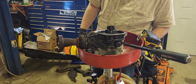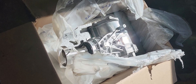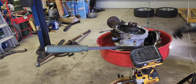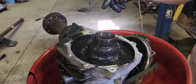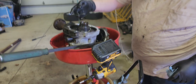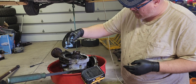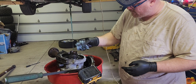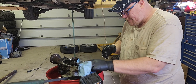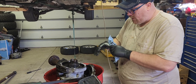We're going to put a brand new one in it — we've got a brand new OEM Ford transfer case sitting right here. That one doesn't make all the bad noises this one does when you spin it. Not a cheap repair, so make sure you do the maintenance on these. You've got to change this oil on a regular interval, and if they're leaking get the seals replaced and the oil changed. That oil is almost the consistency of pudding and has got all kinds of metal and junk in it.